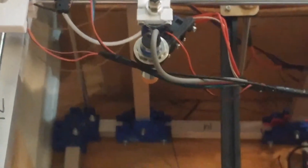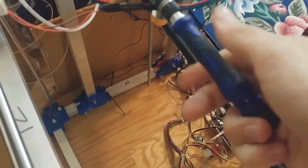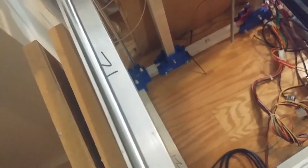Okay, so now we get to the start of breaking down the actual 3D printer. At this point, we have our laser diode mounted to our chocolate extruder assembly, but we don't have a real idea of how we want to mount it yet. I know I need it to go off of these 2 M3 screws that are just slightly off frame right now that are holding on the hot end, but that means I'm going to need some sort of adapter plate to get it there.